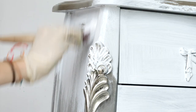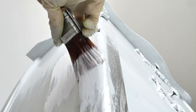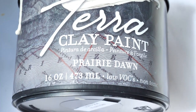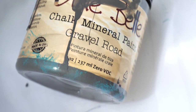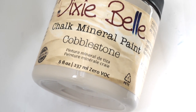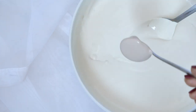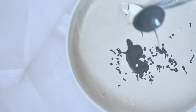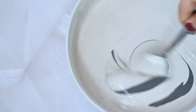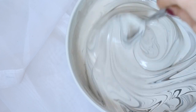After applying two coats I let the piece dry for about 24 hours prior to painting. Meanwhile I prepared the custom color — I wanted a light beige, so I mixed about five or six spoons of white clay paint and then two spoons of the new Dixie Belle color cobblestone. After I mixed it, I realized I wanted a tint of gray in it, so I started to add gravel road until I was happy with the color.